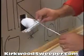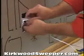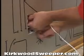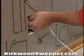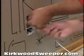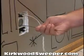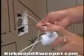Gently insert the mounting bracket into the wall hole, first down, then up, centering it. Get a wire hanger and insert the hooked end of the hanger down into the 90-degree elbow to hold the bracket in place. Then slide the inlet valve into the mounting bracket.